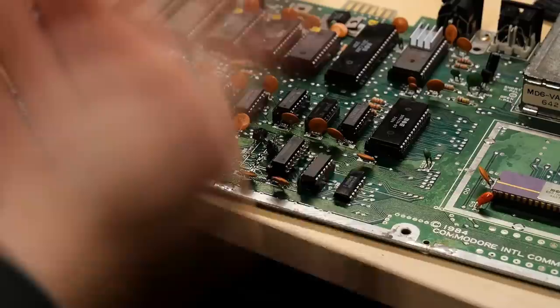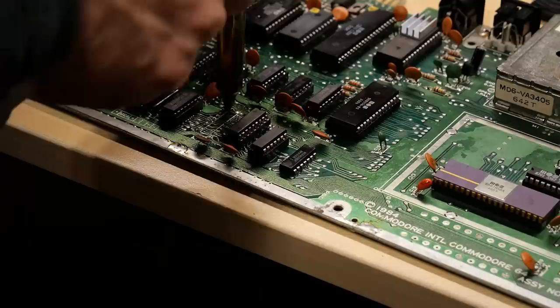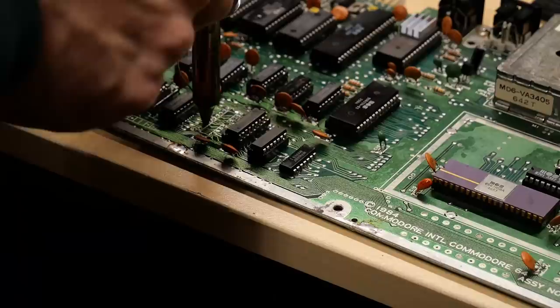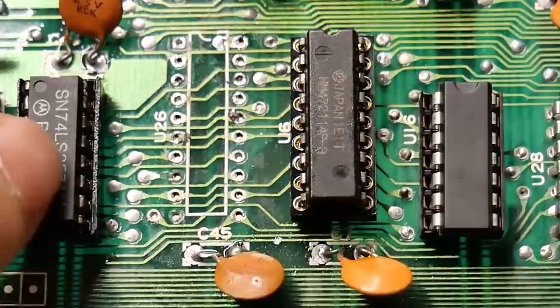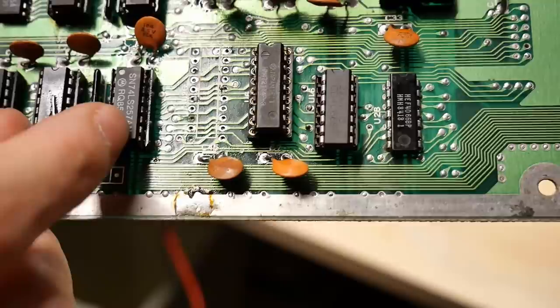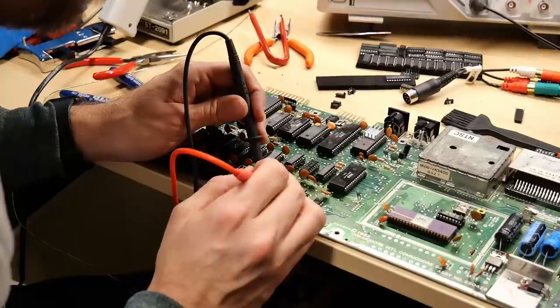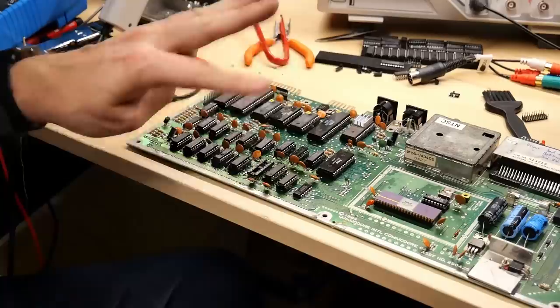I also want to talk about the corrupted character issue. The problem seemed like the character ROM, but I knew that ROM was good. If I had looked at the schematics to see what connected the character ROM to the VIC-2, I would have seen that U26 sits between them. It was pin 8 on U26 that was ripped — the address line impacted is marked in yellow. Even without knowing which address line was bad, checking all pins on U26 with my oscilloscope should have revealed the fault. This shows how valuable schematics are in troubleshooting. So not only was this a crap socket, but there was a lifted trace as well. After removing the pieces, I see a lifted pad, a couple other screwed up pads, and one that's just missing. I'll photograph it before installing a new socket and then repair the damage.